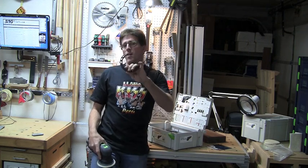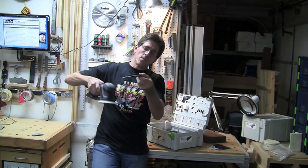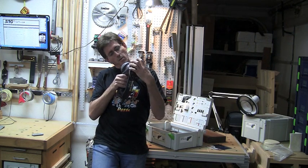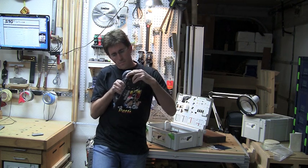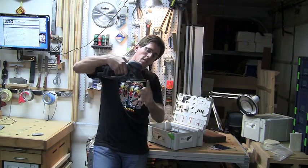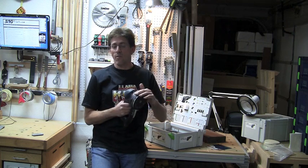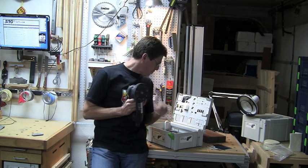The kit itself comes with an edge protector that you can use to keep the head of the sander away from any of the corners. So this will bump the wall before the sanding head will, but it's actually a very close fit. So you just slide this onto the front, and I always seem to miss the first time out. So you can see that you would hit a side face before the sanding pad would start to cut into that face. I typically just leave that on all the time because it's not obtrusive, and that way, if I do get into a corner like that, I don't have to worry about being too lazy to stop and pop this puppy on.